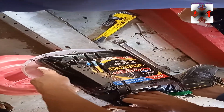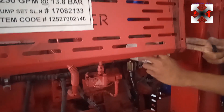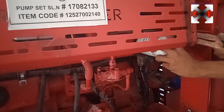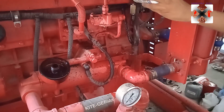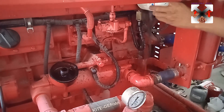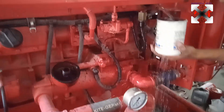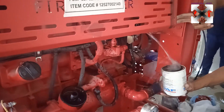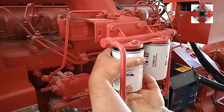Oil changing is very important. This is the dirty oil we drained — look at how it looks. All these things will just be running, so you need to periodically check the oil. Now we remove the coolant filter as well. Before, they had put water in it, so what is coming out is not coolant — it's water. Because it has been there for a very long time it's also blocked, restricting flow, so water will keep coming out as we remove it.